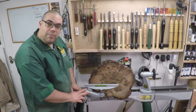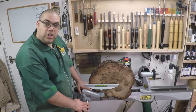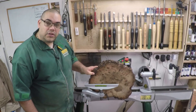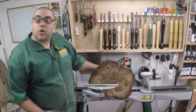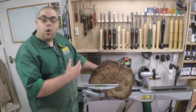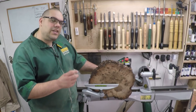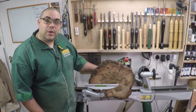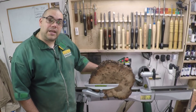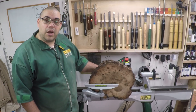I've got my outrigger in place, I've got my large rest, everything's secured down, everything's locked, nothing's going to move. I've put the belt down to the lowest setting so I've got the most amount of power. Although this lathe is incredibly powerful I actually don't need it for the power, it just gives me a little bit more control over the speed. This is not going to be something I can turn quickly. At the moment I've got the speed set to 350 revs and that might even be a little bit too fast once I get going.